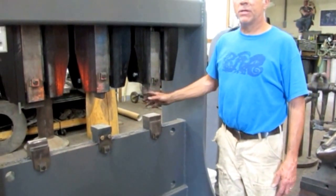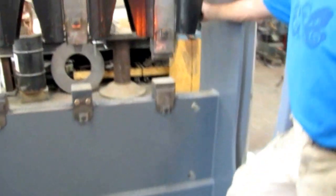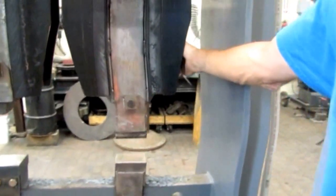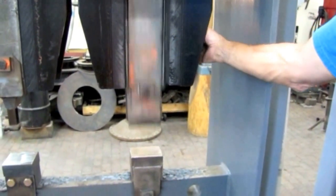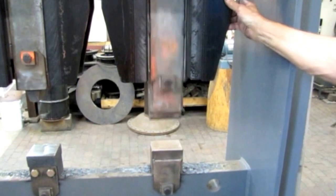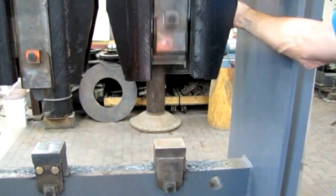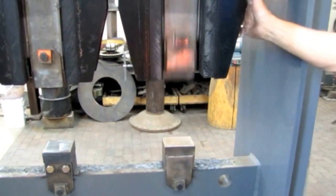It's really important to be able to control your stroke on a power hammer. I've developed a way of doing it very easily. While it's running, I can go from a low stroke to a high stroke. I don't have iron in there, so I'm not going to strike the dies. But it's very convenient. There's a small knob in here — you can't see it on the video.